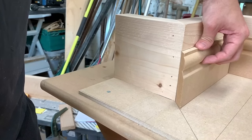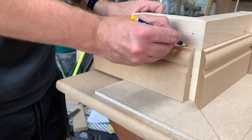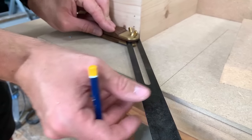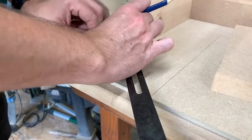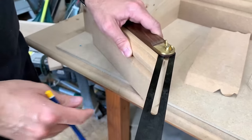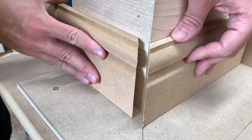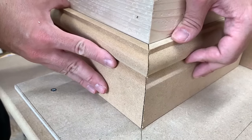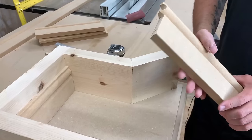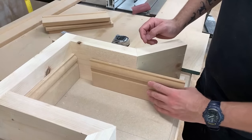Okay, so that's the first piece cut. We just need to do the same thing to this piece here. Put a reference mark that way, set your sliding bevel to the angle again — it should still be set from before. Transfer that angle to your piece and cut that off. Cut accurately, take your time, be careful. To save a bit of time on the video, I've already done the scribe cut for this internal angle, so that just fits over there like that.